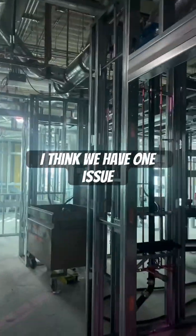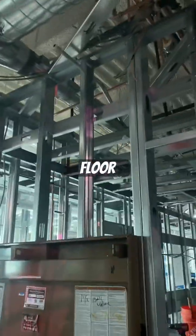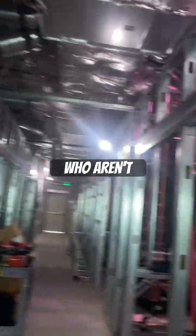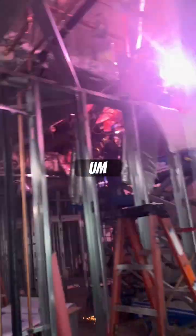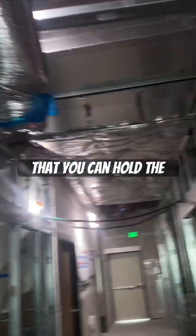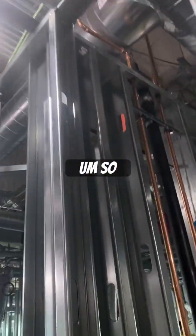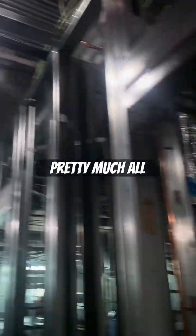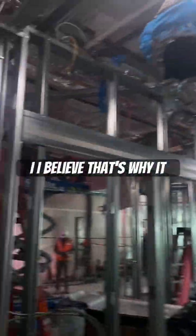We had no issues — well, we had one issue with a clean seal leaking at the bottom floor. For those who aren't familiar with clean seals, they're like these balloons that have a male adapter that you spin into a clean out. Then you pump it up so that it can hold the water going up all the vents and the waste lines. This particular one was put in pretty tight, pretty much all threaded — it wasn't even showing any threads. I believe that's why it was leaking.